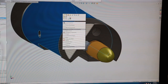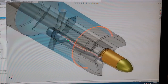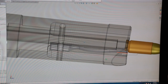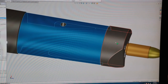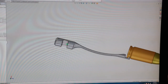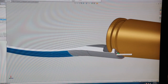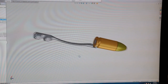Having the extractor at an up angle throws the case up a little bit as opposed to just sideways — this is a really good solution. What's really cool about the Uzi extractor is it's very old school. On all those other guns you had a spring and a pivot point with a retaining pin. The Uzi doesn't have that — it's a big long beam with a bend in it, so it doesn't need to pivot about a pin with a spring. It's its own spring. You have a retaining pin but it doesn't pivot — the pivoting happens just by bending of the beam when the case hits against the angled surface. This is a beautiful system, and Uzi extractors are very available.